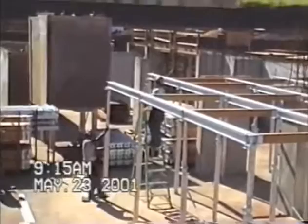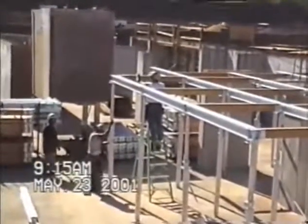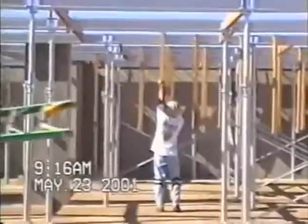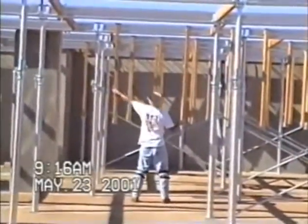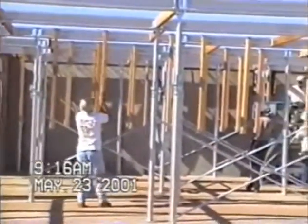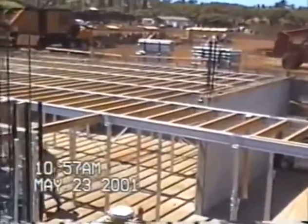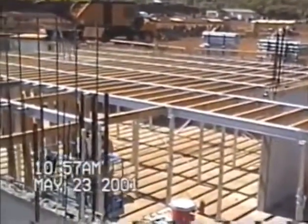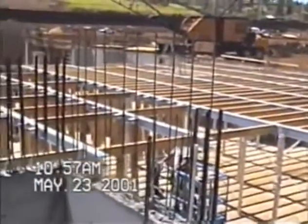You can see the same erection procedure: hang a ledger, tilt up a post, and stabilize with a wood joist. One man is following behind and hanging the intermediate wood joist from the ledgers at the approximate spacing required. It is now 2.5 hours later and we have set over 3,000 square feet of equipment, with most of the intermediate joists also set in place.